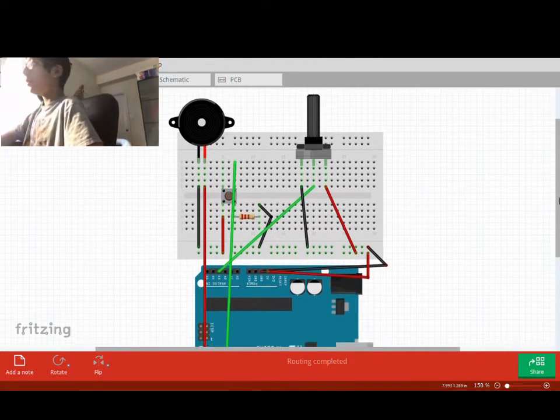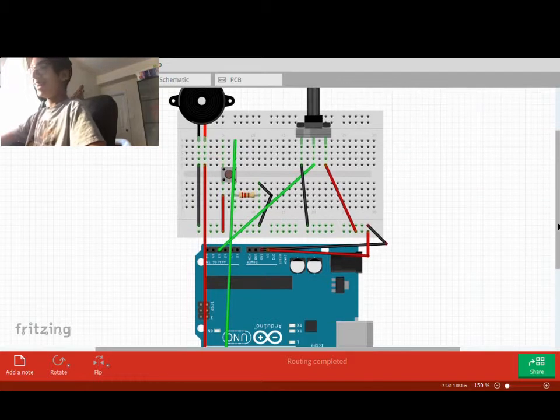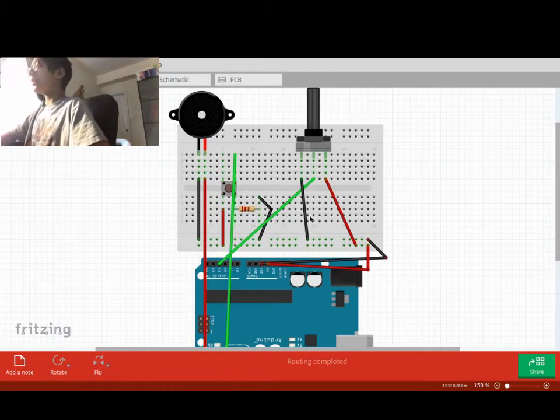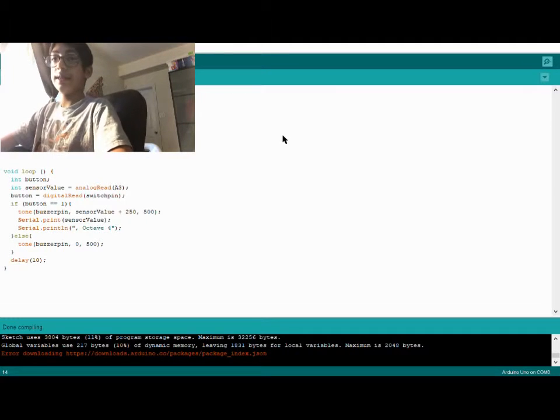Next, we have the potentiometer. The potentiometer is relatively simpler compared to this jumble. So we have the rightmost connected to positive, the middle one connected to analog 3, and the leftmost one connected to the ground rail. So that's a basic explanation of the circuit diagram, and I'll see you guys in the code. So here is the code.